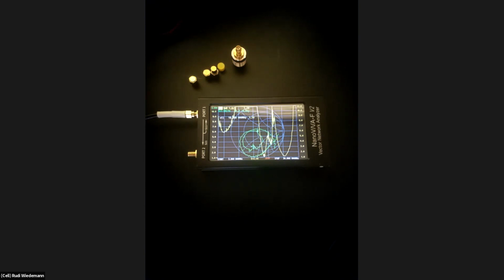So if you've got a buddy pole, a dipole with a pair of matching ham sticks on there, then typical tuning is to change the position of the stingers. And obviously you want them at the same length on both sides. And you can get a ruler. Hold on, let's just get clear. He doesn't have ham sticks. Yeah, but his buddy pole has a coil with taps on it and a stinger. Right. Okay. Little bit different than what I have.